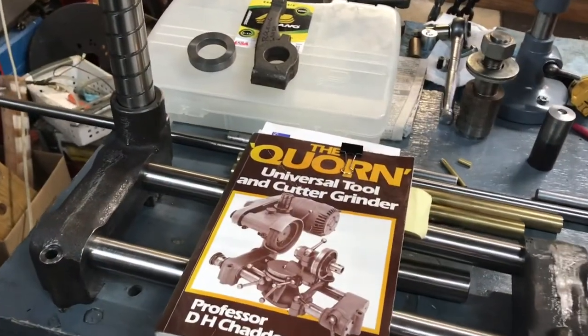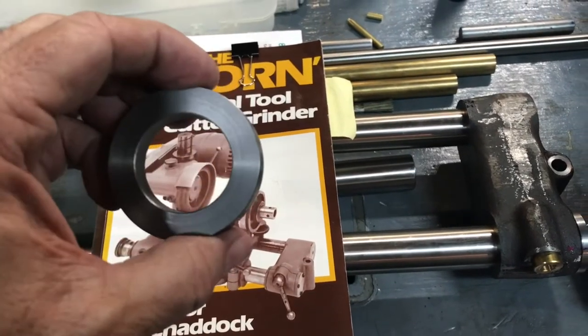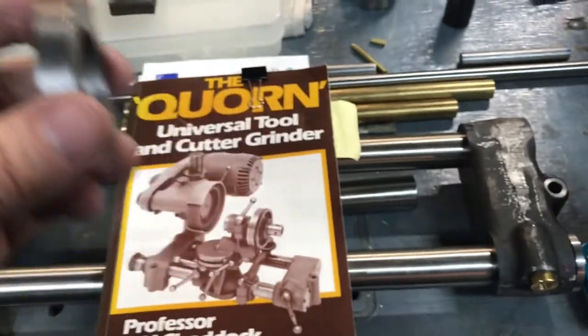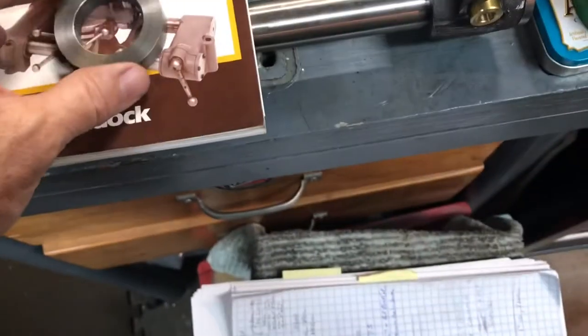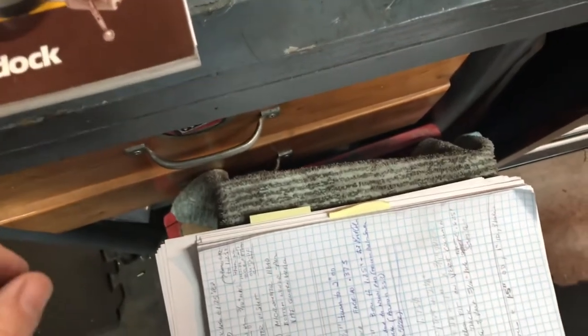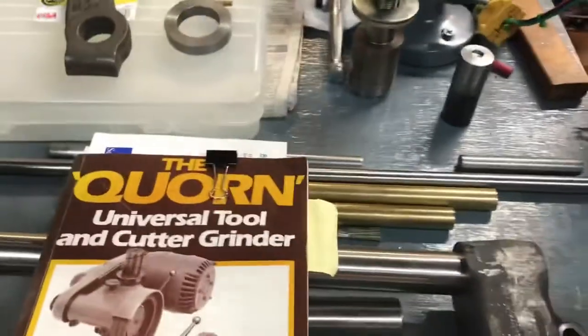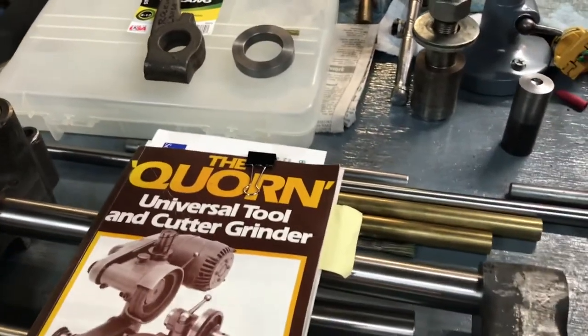I finished the basic machining for the wheel head nut. This is what the piece of cast iron looks like when it's been faced, bored, and the outside diameter turned true. I broke the edges with a file so they're not terribly sharp, and it fits — it's a loose fit on the vertical column. There will be a nylon piece I have yet to get, and I'm actually thinking about using brass instead of steel or stainless for the peg that rides in the slot. More on that later; the next processes need to happen in the mill.